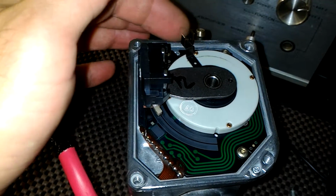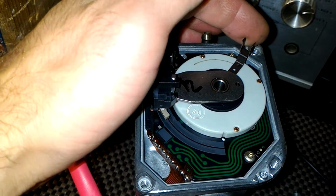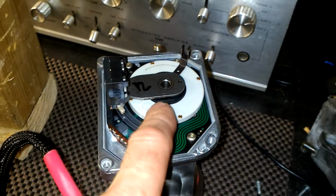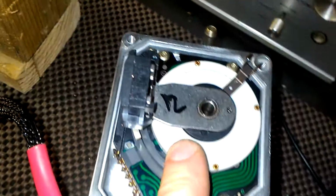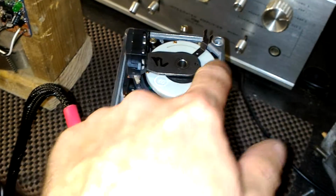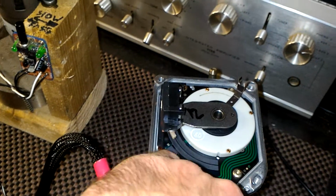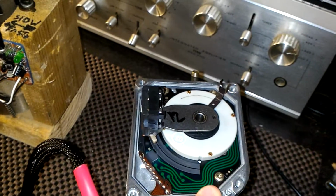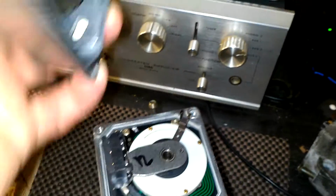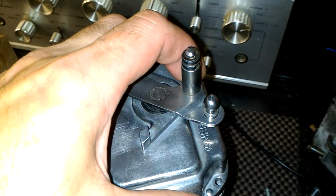This potentiometer is nice and tight. This unit is actually pretty nice. I mean, I actually like the potentiometer a lot, because you see how whitish it is. That's good, because that tells you that it was never overheated, because usually overheated units become yellowish. This one is fine. So no water actually came out around potentiometer, which is super important. If there is water in potentiometer, that can cause damage pretty fast.